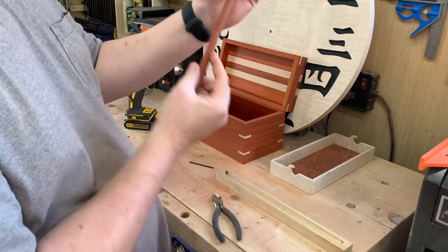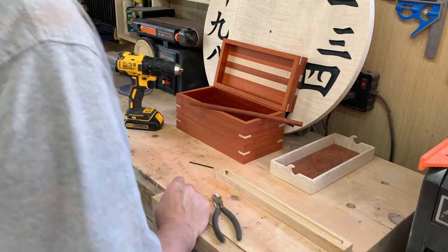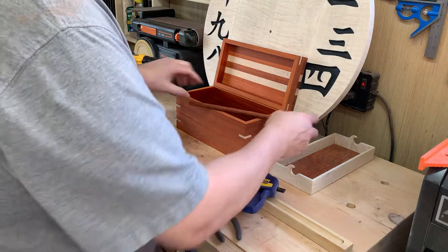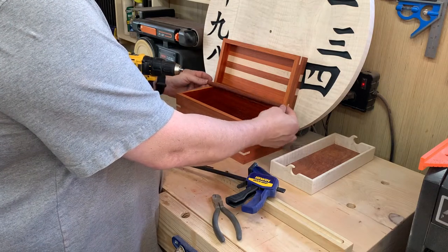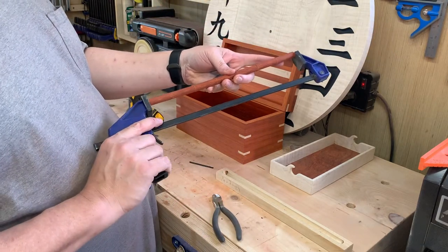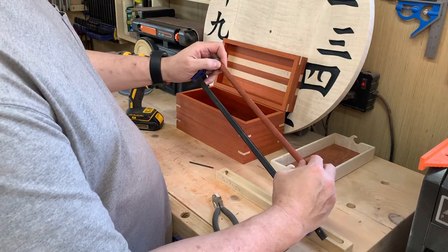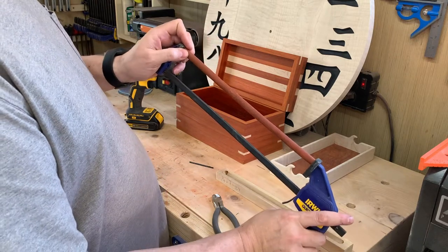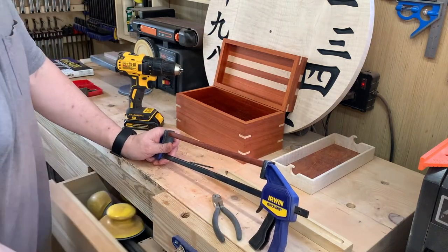You can hear that sink home really good. And there's our dowel. Reassembled, nice and crooked. Then what I like to do, of course, make sure that we've got enough, and we do. Got enough, plenty actually, sticking out both ends. And I like to clamp these up. The reason I do this with the marks inward is so that I don't lose my marking. So do this, and then I just sand this smooth. And that's the next step.